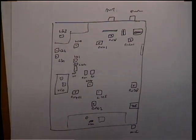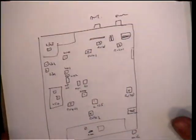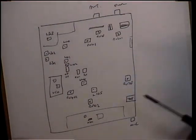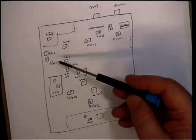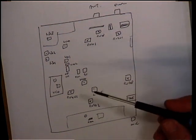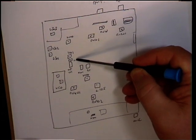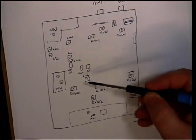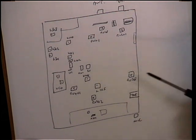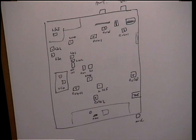I've looked at the printed circuit board. I can see that we've got the VCO section there in the can, so we don't need to touch that unless something's out of lock. I can see that 301, 302, and 303 are going to be the transmit tune-up. I can see that 100, 101, 102 are going to be the receive front end. 104 and 105 are going to be IF. Of course, what the presets do I haven't got the foggiest, so we'll have to mess up mine and find out. But that doesn't matter — we can put it all back right.